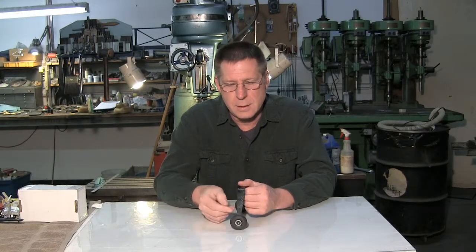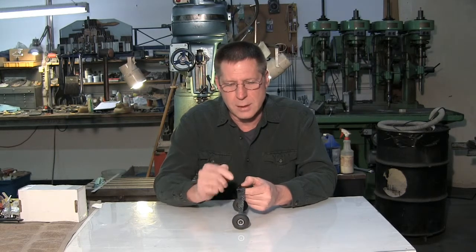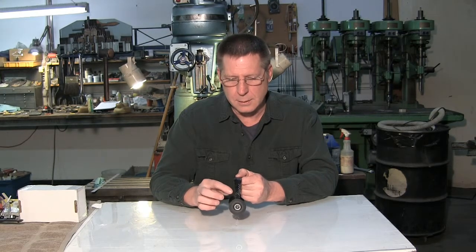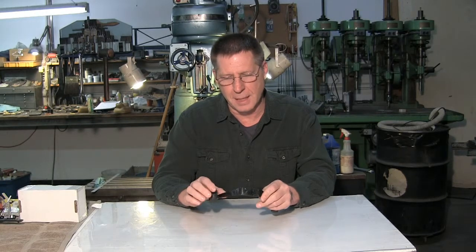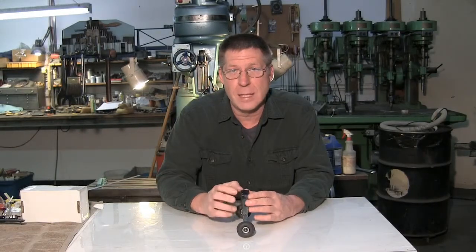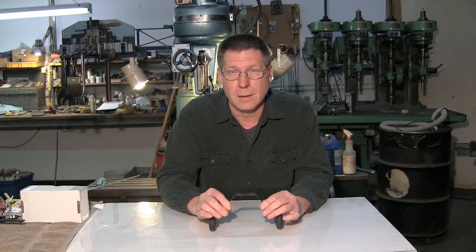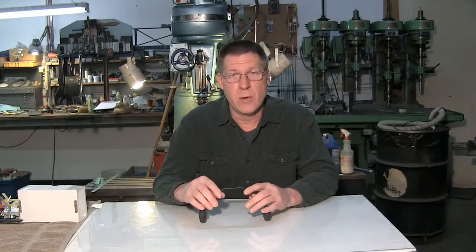To handle the taper in the legs, take your one-inch-wide layers of carbon fiber and in the mold actually fold over the carbon fiber to make the taper. When you're done it'll be thicker at the bottom than at the top, but you need that because you made it narrower, so you need more material there — plus I like my landing gear to be springier at the top than at the bottom. If you have any additional questions or I didn't cover something you want to know, please post your question in the comments below or go to rcplanemaker.com and post in the forums. I hope you find this video useful and we'll make more videos on other things in the future. So now we'll go out and do some flying.